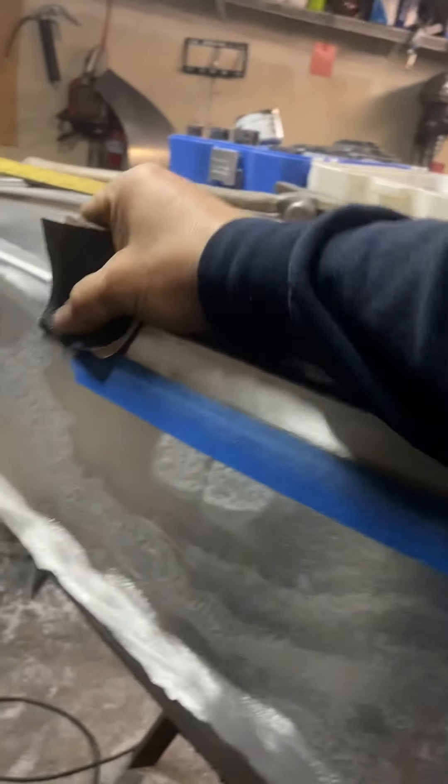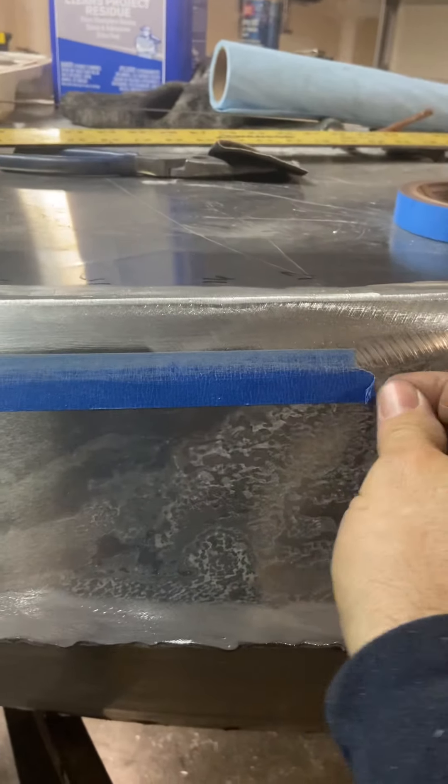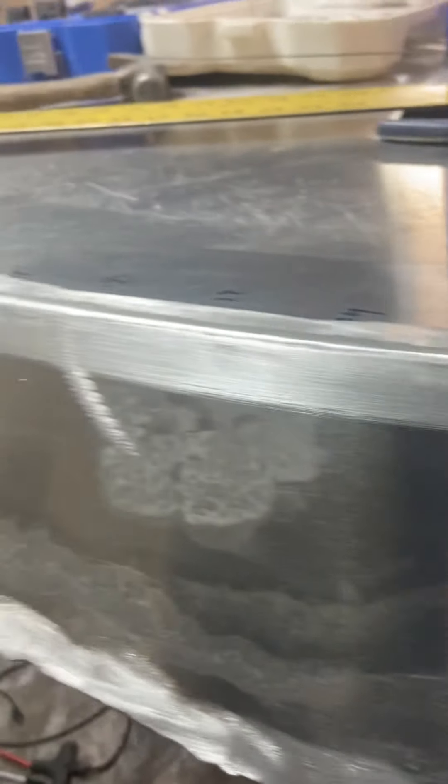So how do you get that nice satin look? Good old-fashioned 80-grit sandpaper, and it is very simple — literally just doing this by hand. There's no cheating with power tools or anything like that. With aluminum, you have to go in one direction and one direction only. Otherwise you'll get grind marks, gouges, and all kinds of undesirable stuff. In about 30 to 45 seconds you can peel that off and start to see what I'm talking about. You can start to see how satiny that looks compared to the flapper wheel result. That kind of new-ish look requires one-directional, old-fashioned elbow grease hand sanding.